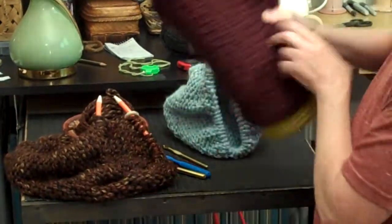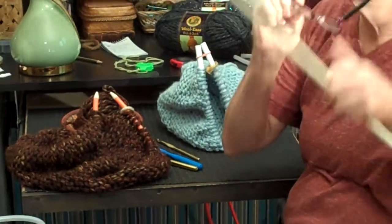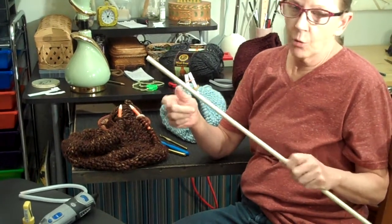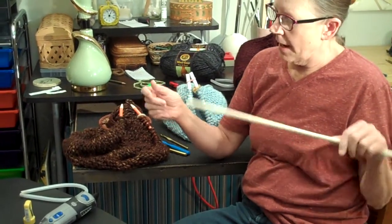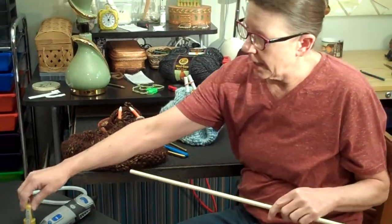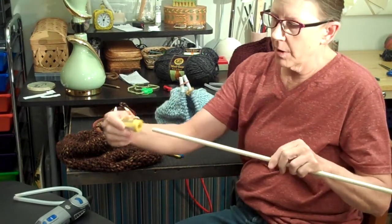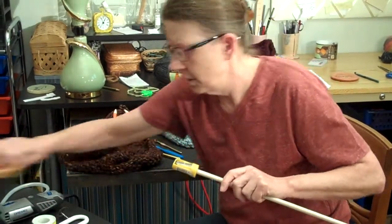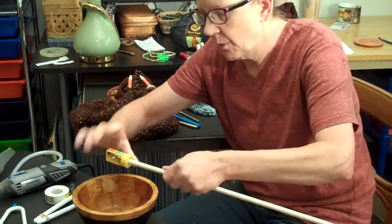All you need to do is get a very cheap dowel rod — one that's made of pine. You can get them at Walmart or the hobby stores. If you get it at the home center like Home Depot or Lowe's, it's going to be poplar and it's a little harder to cut. Most people don't have a pencil sharpener that will hold a 3/8-inch dowel rod — that's the size you need. You can buy a pencil sharpener like this; it's meant for those flat carpenter's pencils, but your dowel rod will fit in that opening. Make your point first — don't cut it first. Make your point with your pencil sharpener.